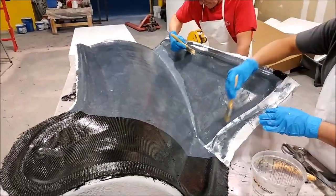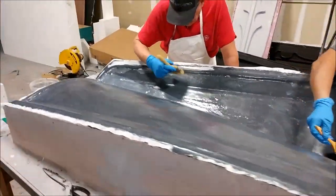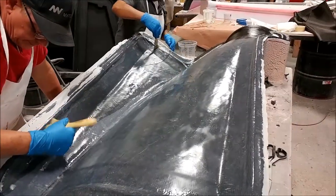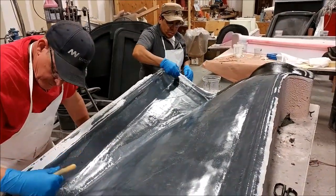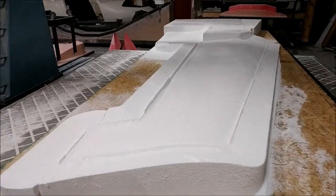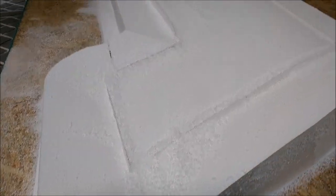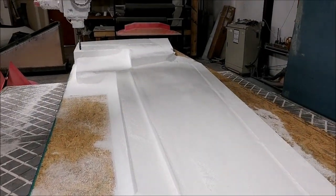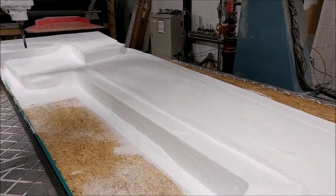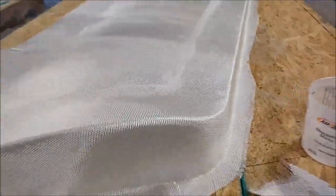Chris and Roberto were in again on Wednesday and this time they're working on the mold for the right side cowling. You can see they're basically just at the peel ply level, almost finished off laying the first light layers on that, so that one will be ready for heavy layers. Here's our lower left side wing skin plug, sort of halfway through on the machine — all the face cuts have been done on the outboard side of the wing.